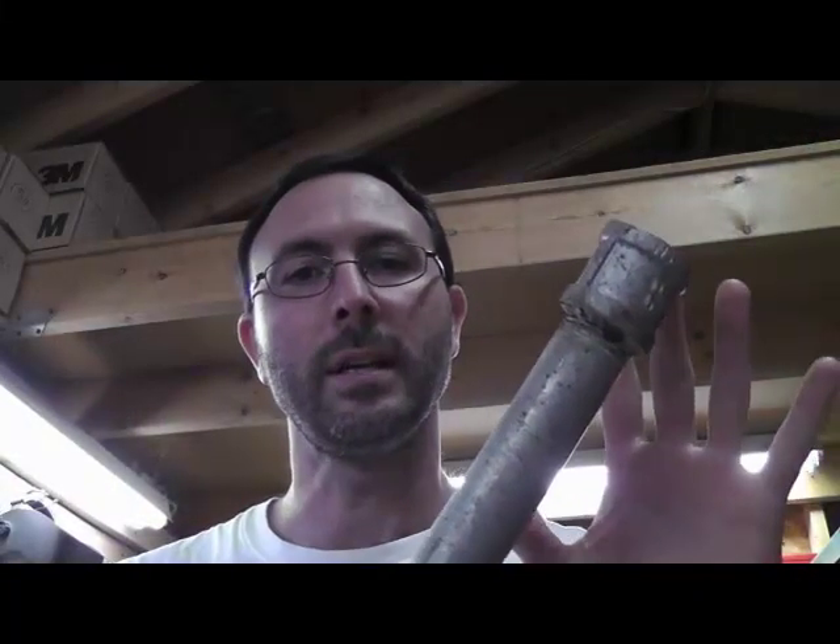You may be tempted to make your own extension rods using standard round galvanized water pipe. It seems like a good idea at first — in fact, our early EXP50s were made using that — but there are some serious problems in the field. First, and probably the biggest, is the threading. Threadings are not standard size. When you go around the world, you'll find French, German, British, metric — all kinds of different threads, depending on what kind of tap they have available. So matching these threads with the collars becomes very difficult.